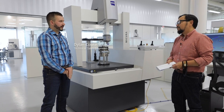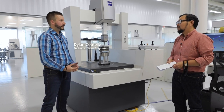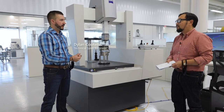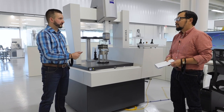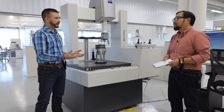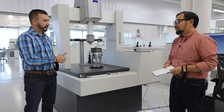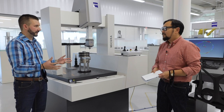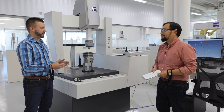Can you give us some examples of what to look for and how to solve it? So when most customers contact us because they're failing a gauge R&R, they think one of two things: either their machine isn't accurate enough, which normally isn't the case, or their program isn't good enough, which we have a lot of high-level programmers so that's normally not the case either. Normally if you're failing a gauge R&R it's a big picture item — something like fixturing, part handling, styli, environment. All those are really simple things that we sometimes overlook and it causes us to fail gauge R&R.